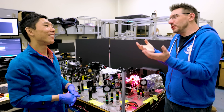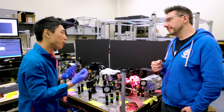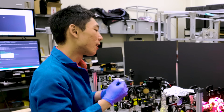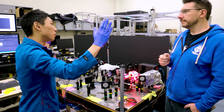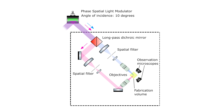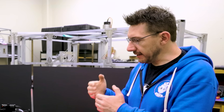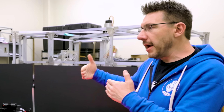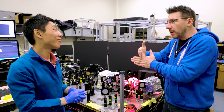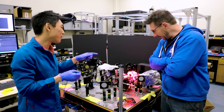That's so cool. Why would you need two holograms to do this? So traditionally, people have used holograms to do 3D printing before, but the limitation is that each hologram has its resolution limit. The axial resolution along the beam is particularly poor relative to the lateral resolution. So here we are using two holograms projected into the material so that the two holograms can complement each other and pattern features aligned in a particular direction better. So a single hologram loses detail along the axial dimension — along the laser beam — and at a right angle you project another one, so these two holograms together take the detail from each one. Exactly, you get it perfectly.